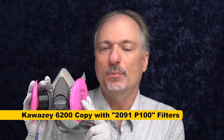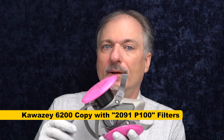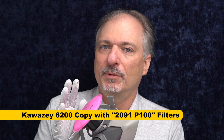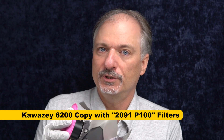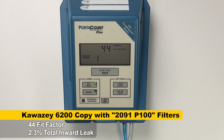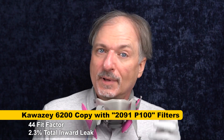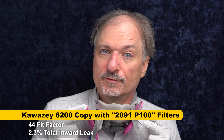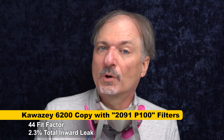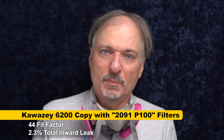I've hooked up the Chinese respirator to the sampling system and we're going to test it. As before, we'll purge the mask for a few minutes first. I'm using their supplied filters as well, so I'm testing their entire system — the mask plus their filters. The result: 44. This mask failed the fit test. I did feel a leak at the nose bridge area. I have fit tested this exact mask before and it passed, but that defect makes it variable enough that it's on the cusp. A score of 44 is less than the passing score of 100 required, and way less than the thousands that the real 3M mask passed at. The variability of this copy is why it failed.